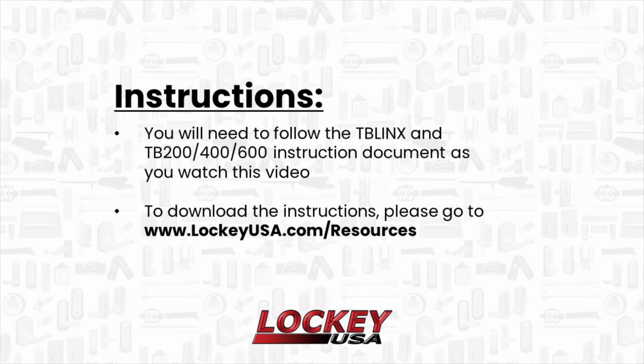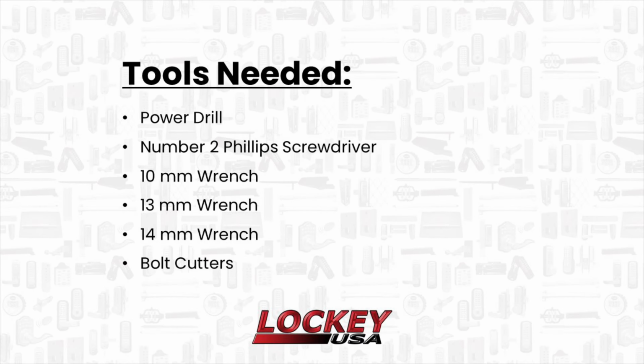To download the instructions, please go to www.LockeyUSA.com/resources. The tools you will need to install your hydraulic gate closer on a chain link gate are a power drill, a number 2 Phillips screwdriver, a 10, 13, and 14 mm wrench, and bolt cutters.